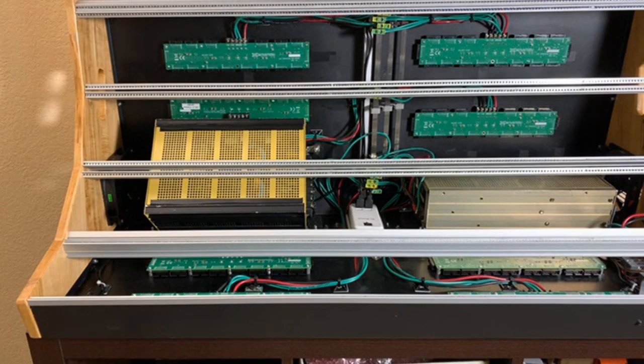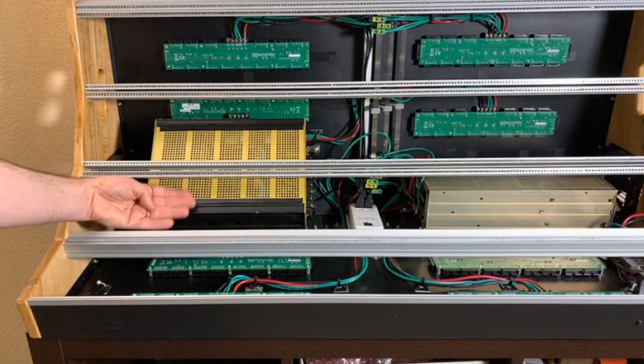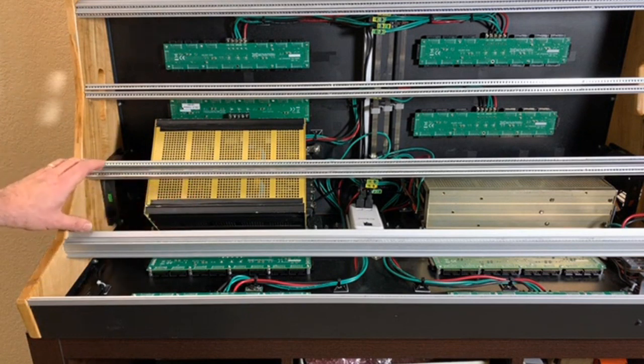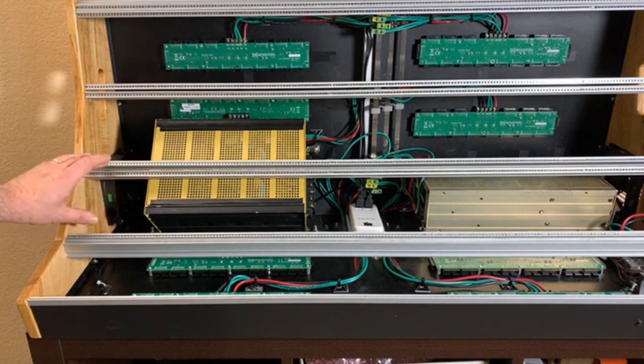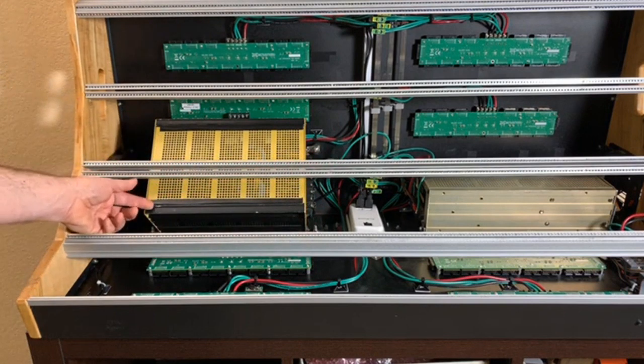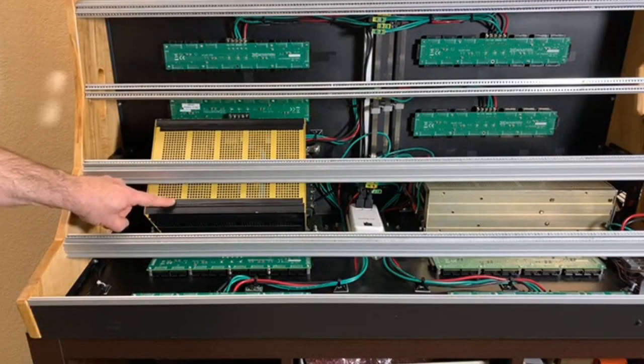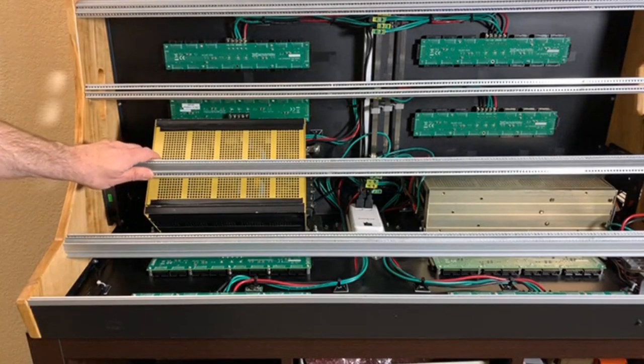And eventually the solution was, one, to mount it at an angle, so it's kind of parallel to this particular row of modules, and two, make sure I had some very thin skiffable modules just in this particular section, so there was some clearance here. And I have about 45 millimeters of clearance between the power supply and the front of these rails.